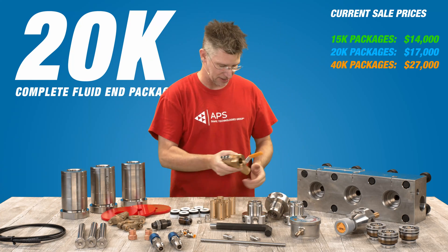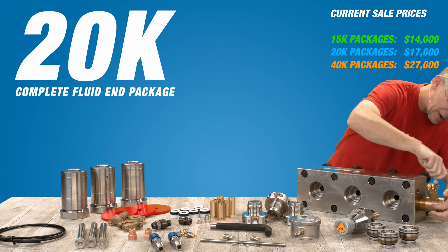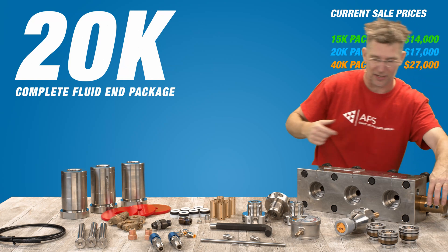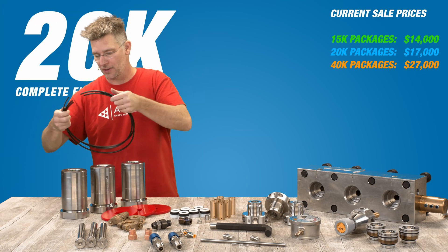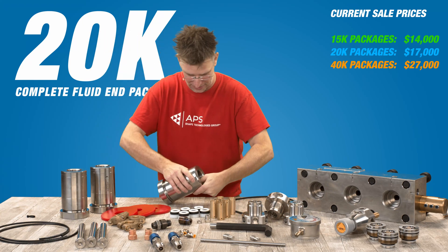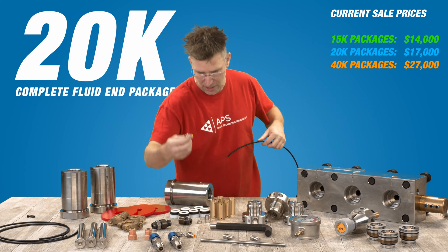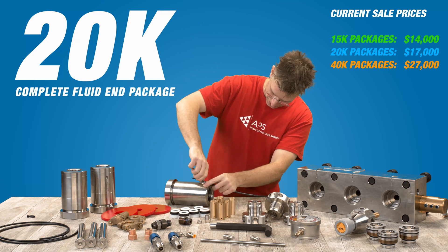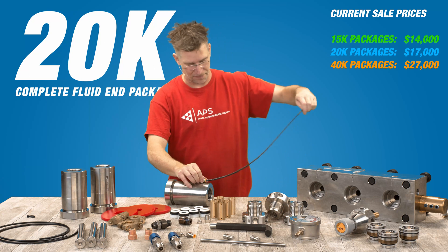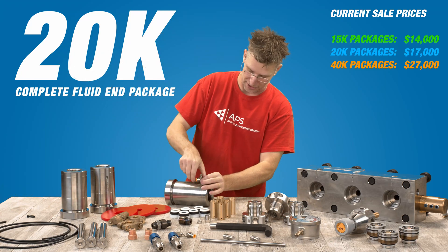We also have the lube harness. This would go and thread in right here. You're going to have three black hoses that run through these — these are your quick connects for the air connectors. That would then run over to your stuffing box set up inside the pump; it's going to look something like this. You're going to have this hose connected in there, coming over to this stuffing box where you have these connectors — some 90s. These are 1/8-inch MPTs, and they have a little adjustment on the top. Your hose is just going to push in and connect right there. You get three of these — three on the lube harness.